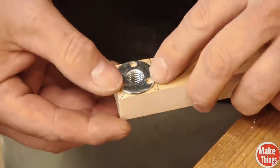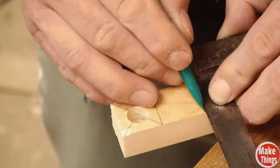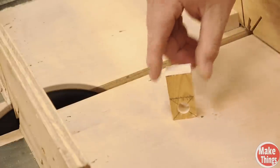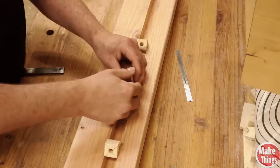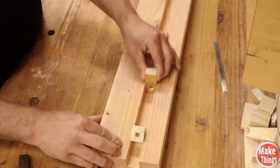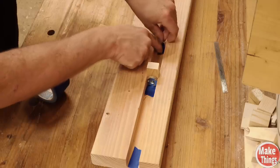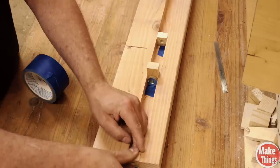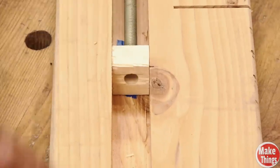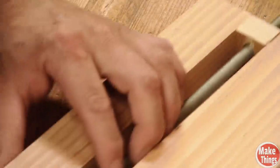You can see that this brad t-nut fits loose inside. Next we'll add another inch to the end of the board so that the pin is about two inches long, and we'll cut it off at the table saw. We definitely don't want the pin snug, so I used a little sandpaper to remove enough that it moves smoothly in the track. We'll add tape under the pin and under both stop blocks to make sure they're even in the track, then thread the threaded rod through the first stop block, the brad t-nut and pin, and then the second stop block. With epoxy, we'll glue the t-nut to the pin and allow it to semi-cure.